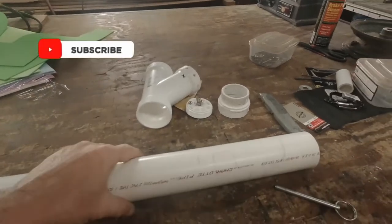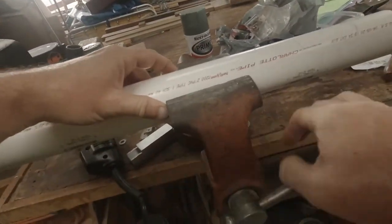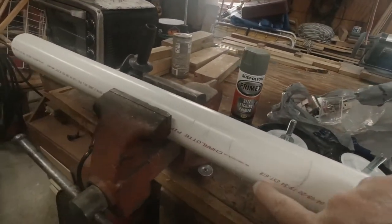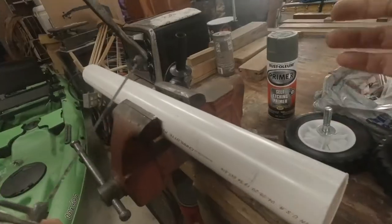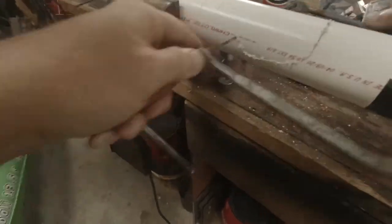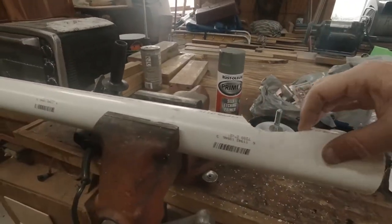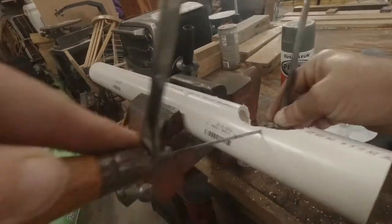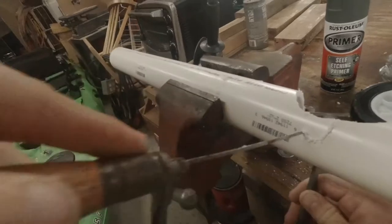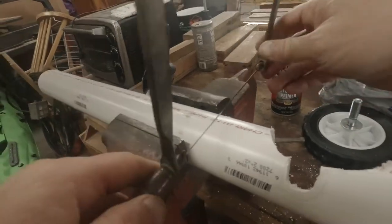Now I'm going to put in the part where you can drop the rod in. That's going to be simple enough — I'm just going to use a coping saw, a very simple device to use. I'm going to put it right here in the vise. I drew a line where it's going to have a notch here on each side for doing a spinning rig. Now I've turned it over — I've got this notch here and I'm going to cut it out. The reason I'm using the coping saw is because of how fast a radius it can turn, and it's usually very sharp.